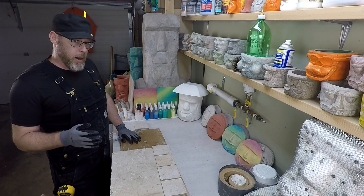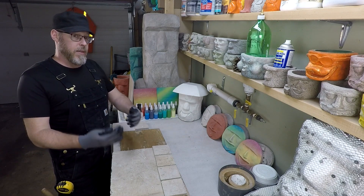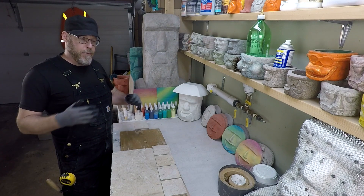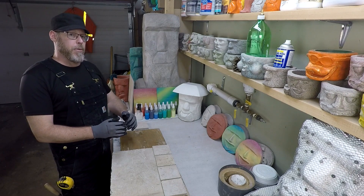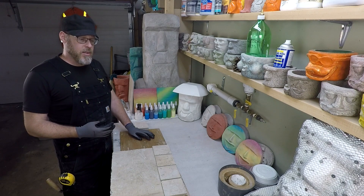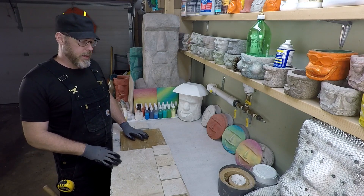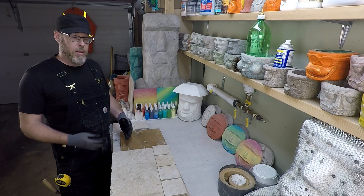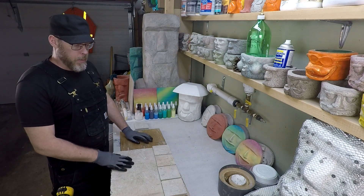I think that's the most common problem with a cracking tile floor. It's more complicated than just thickness because there are even more steps that add to the total elevation of the floor, and you can't have your tile floor be a half step up above the rest of your house. I see that all the time — especially in older installations, the tile gets installed on something pretty strong but ultimately not strong enough, and in 10 or 20 years you've got broken tiles everywhere. When you install tile, you're investing in something with an impressively long service life, supposing it gets installed correctly and maintained properly.